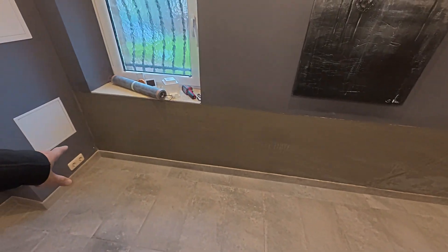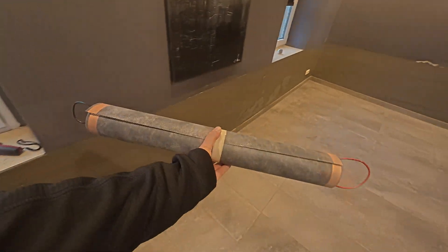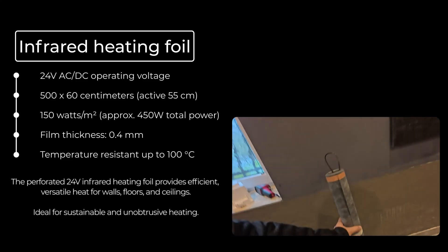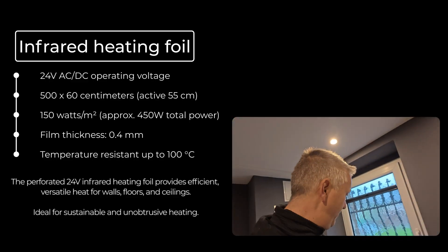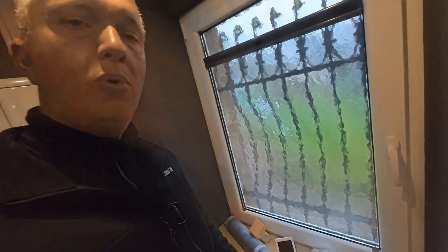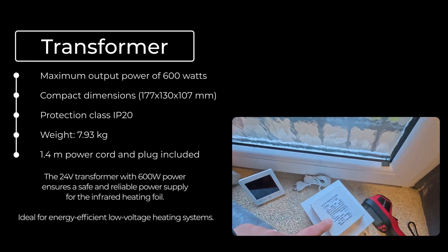The downside of traditional infrared systems is that they work in a very localized way — like the units from the restaurant industry that heat the table and guests but leave everything around them cold. Now I want to embed a surface heating film into this lower area. It's five meters long, exactly enough to go from the back to the front partition wall, and 60 centimeters high, fitting perfectly in this area which I've already sealed with a waterproofing slurry. For the electrical connection there are only two cables — a positive and a negative pole — because this system runs on 24 volts DC. To step down the 220 volts AC from the house wiring, I bought a 24 volt transformer.